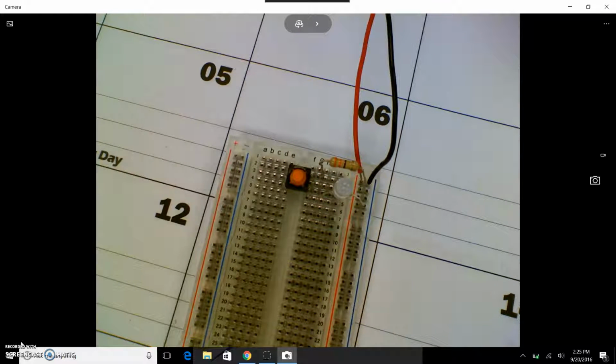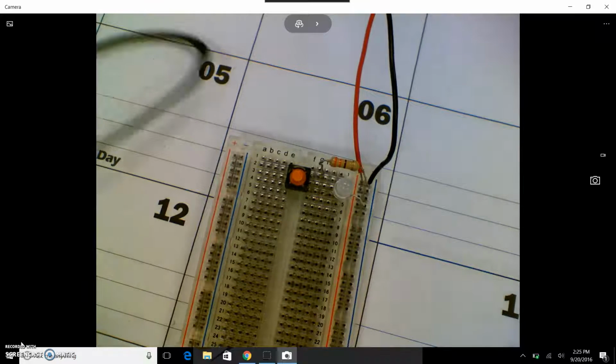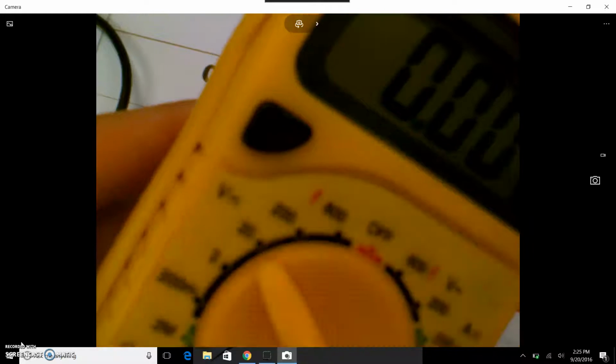The lab then asks you to take measurements. You cannot measure the current because, one, our multimeters are not accurate enough. Okay, they're not fancy enough. And two, the current is so small it's hard to measure. So use a current of 0.02 amps or 20 milliamps as your consistent total current. Your multimeter or your voltmeter needs to go to 20. Okay?